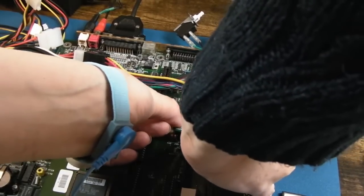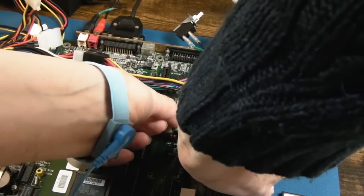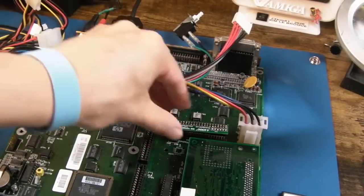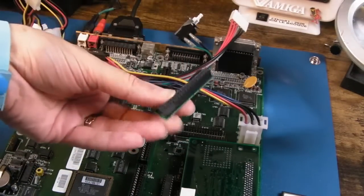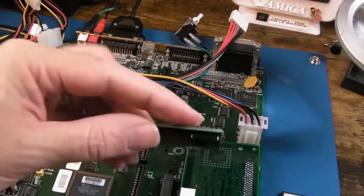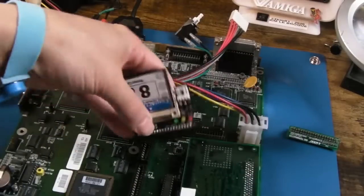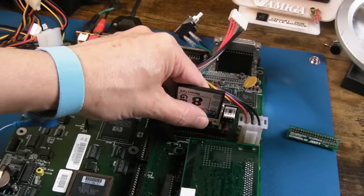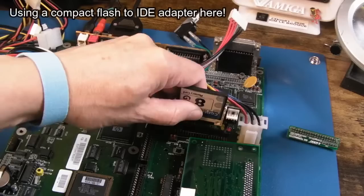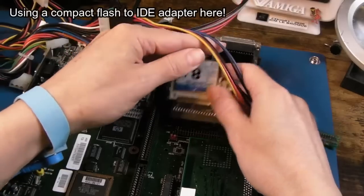It just has two resistors between a couple of data bits and ground, I think, that pull them low. That means when it queries the IDE, because those two signals are low, it says you've got no drive connected, or something like that. There might even be more than two. I think there's a resistor row with four resistors on it, but only two of them are used. So we can get this on, being very careful to make sure it's correctly aligned, because if you misalign something like this, you'll kill the IDE interface. Hang on, let me make sure I am getting this aligned properly.